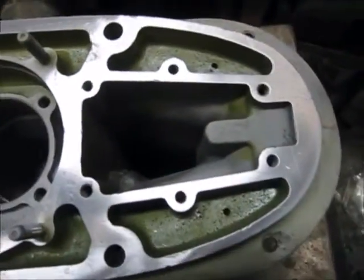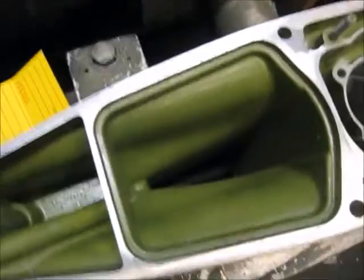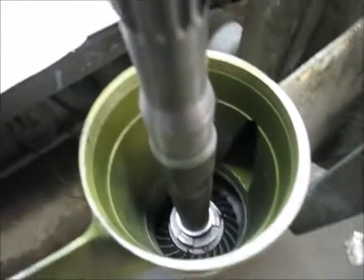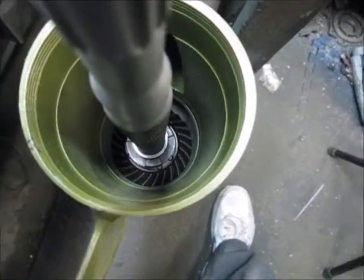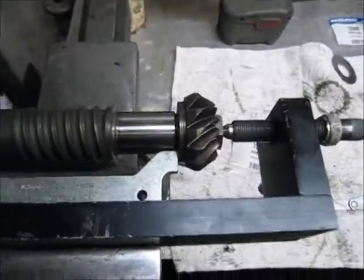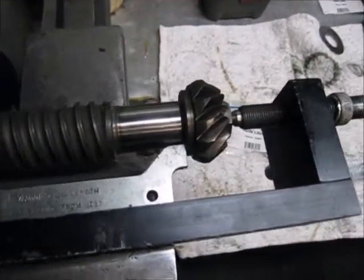For anyone who's not sure what it looks like — this is a 400 series after we've cleaned it up. This is a job that was brought in for repair. We cleaned the inside but not the outside, and we just started to put it back together. This hub is 3 and 3 quarter inches on the inside — 3 and 3 quarters is the 400 series. 4 and 1 quarter would be the 800 series, if you're not sure which outdrive you have. That concludes the shimming. If you have any questions or run into any problems, just give Tech Services a call for TC Electronics and Marine. Thank you. Thanks for watching.